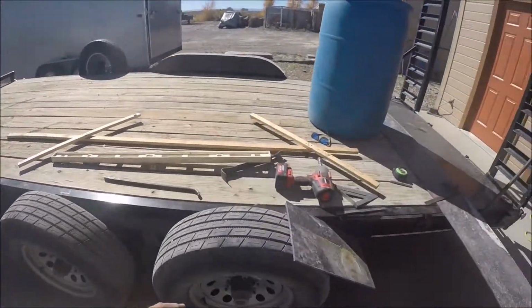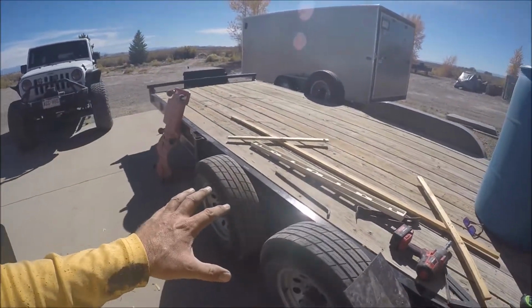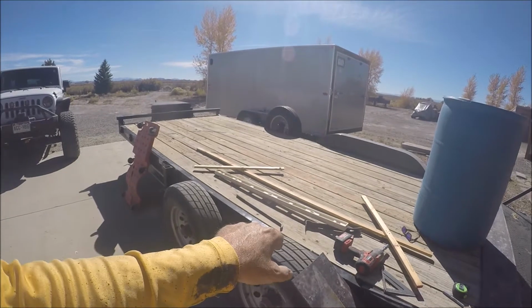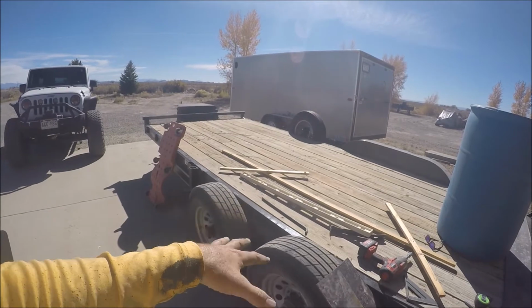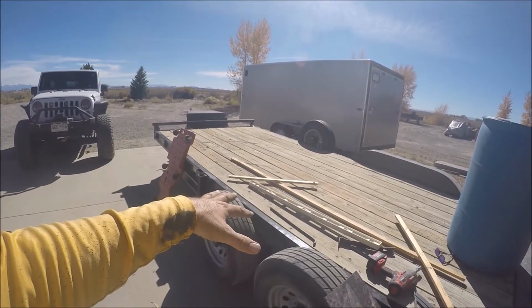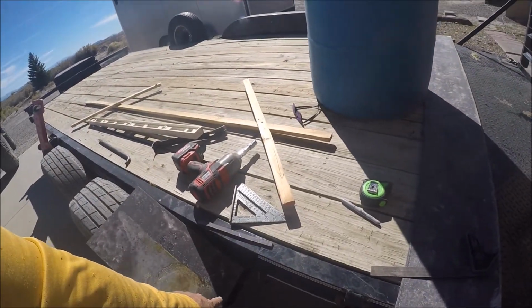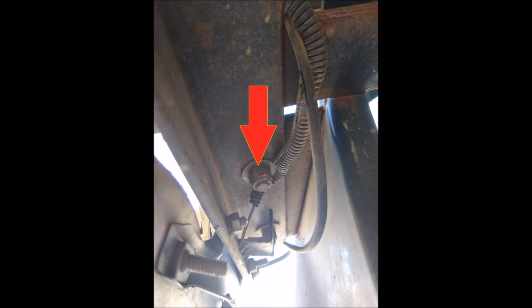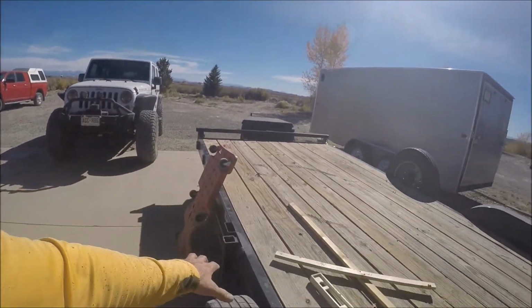we made a mistake, just to share this with you, on this back piece right here. We take the fender off a couple times, either to put a real wide four-wheel drive on it that was too wide to fit between the fenders, or to open a door on a car that was real low to the ground. We popped the fender off, and we tightened the bolt onto one of the wires, the brown wire, the marker light wire, and lost the marker light. It melted the brown wire from here all the way forward, so I've got to replace that.